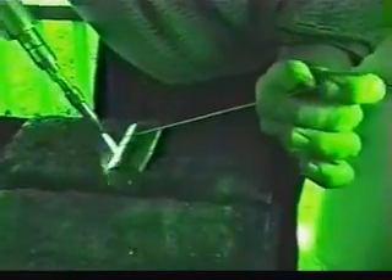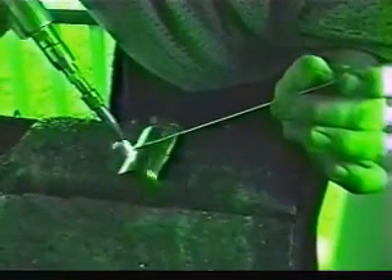Just keep that just up off of the metal. Stainless is the only metal that we have to use that carburizing flame. And that's just a standard stainless steel TIG rod.